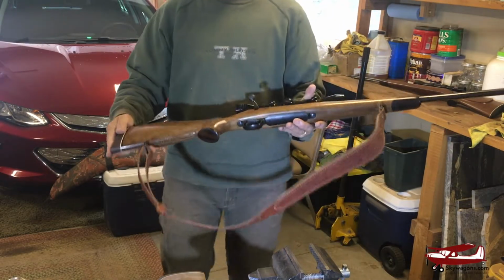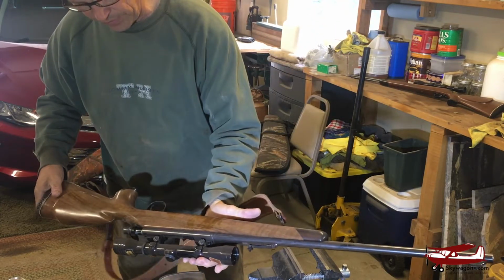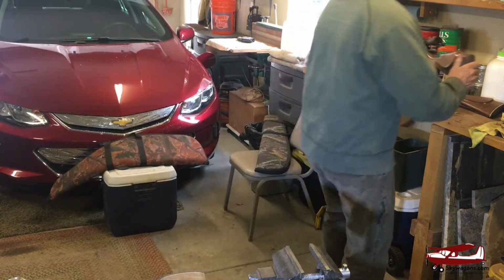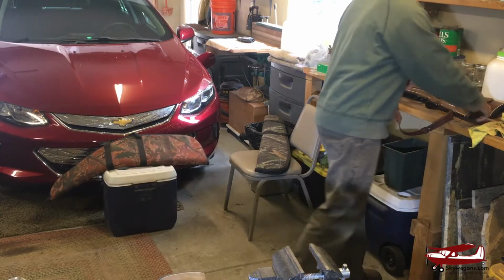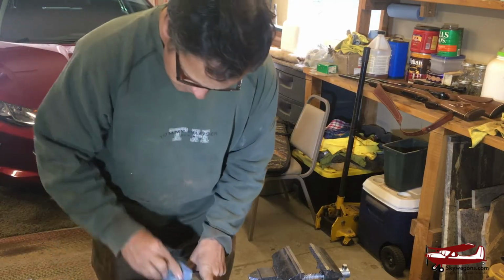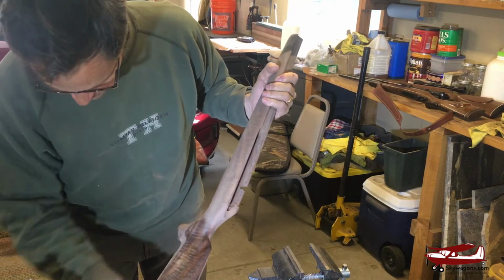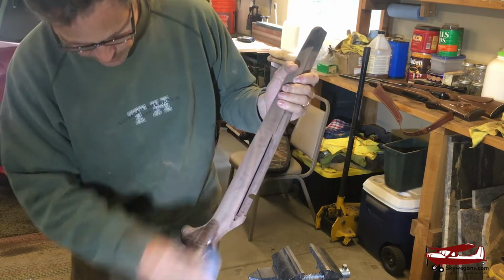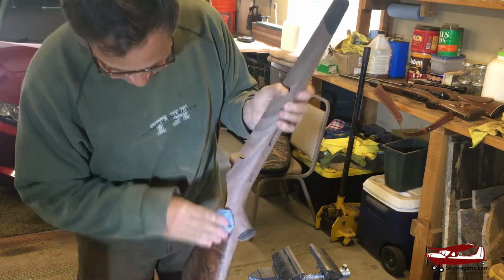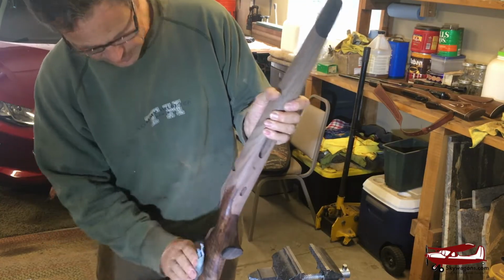Remington 700. It's a bit dusty because it's in here, but that one, that's an oil finish on there, just the way I'm going to do this one. So, a bit of lacquer thinner, and this is also where you get to see for the first time what your wood's really going to be like. So you just wipe it in, get all the dust in there, wipe it in the holes. And it evaporates very fast. So it's not like you're wetting it with water and then in a few minutes it's dry again.